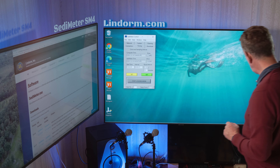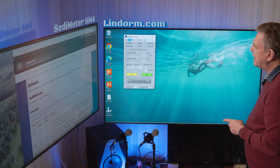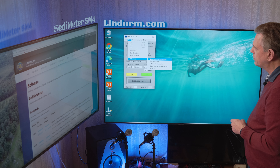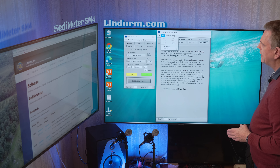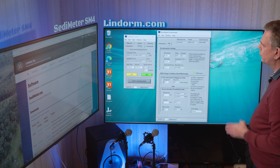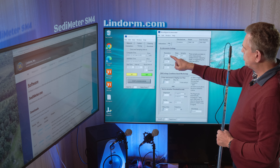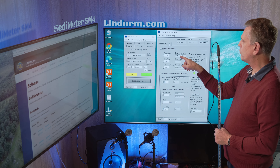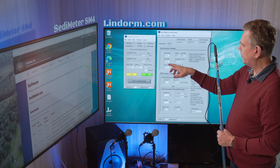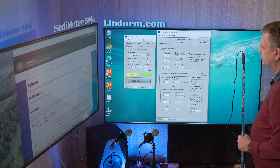The way to do that is to open the software. In this new version, go to Edit > Advanced > Reconfigure Accelerometer. Here are the instructions. Go to Edit > Get Settings — this reads in the settings currently in the accelerometer in the sedimeter. Here we see 8 bits, which represents 256 steps of g-force, and 30 samples. The data rate is 10 hertz by default, so sampling time becomes three seconds. The full scale range is plus or minus 2g, and you can change this to 4, 8, or 16g.